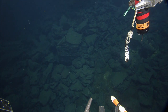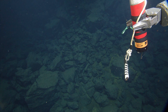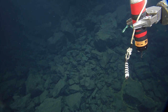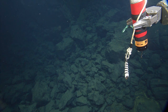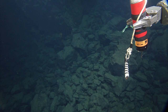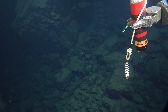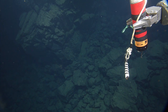There's a lot of buoyancy on this. You know how a glass sphere would make a really good sonar target? Would a syntactic foam sphere do the same? It depends on the paint and the material. I know some foams can be acoustically transparent, like they're designed to be, but most of them aren't though. So it depends on the paint. That's crazy. I always thought it was the air inside reflecting it, but it's the surface. Doesn't really matter what's inside. It does matter. It's a little bit of both. But if you put a hard shell on the outside, it's a surface that won't penetrate.